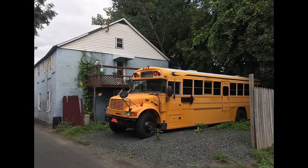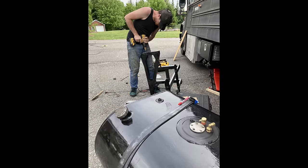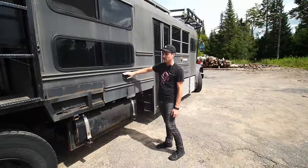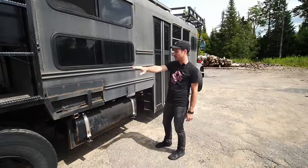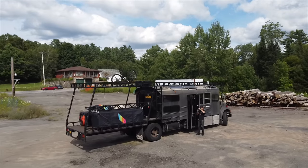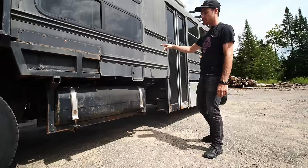The original location of the fuel tank on this bus was in the middle of the frame behind the rear axle. In order to fill it up, it had a tube that came way up to this level. So I had to get rid of that to make my flatbed. I moved the fuel tank up to here — this is the original tank, just in a new location. On the other side I've added a second tank just for added capacity.